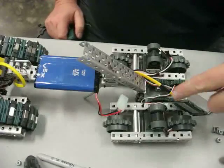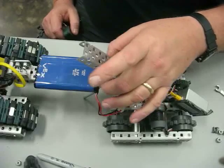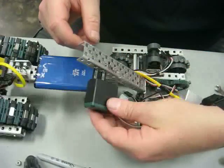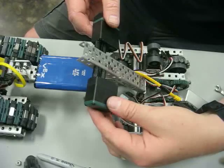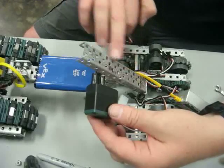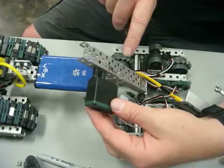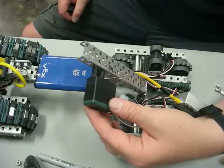Here's the progress we've made so far. We've taken and extended this middle piece up, and we've cut this center piece — this pivot right here that goes in the center — to where they will mount together. We still have the 45-degree gussets here and here, and then we're going to take the servos and mount them somewhere along those lines once we figure out what position will allow the tank tread to clear. Don't cut any major pieces off — don't cut it short because you can't put it back once it's cut short. We're going to run a chain from servo down to a gear right there.